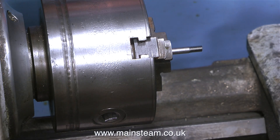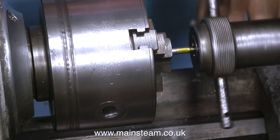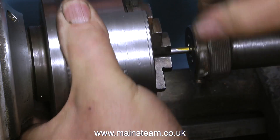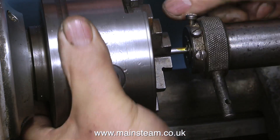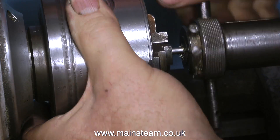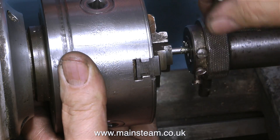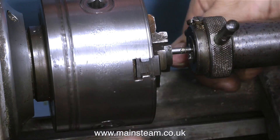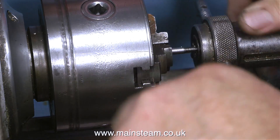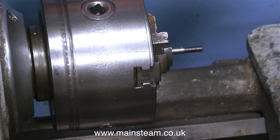The second reason is that a 2BA thread is quite a coarse thread, so the chippings coming off the piece of steel are quite large, and the three holes in the die are unable to contain this quantity of swarf. If you're cutting a finer pitch thread — for instance quarter by 40 or quarter by 32 — the chippings are a lot smaller and do tend to fall out of the holes. But as you can clearly see here, most of the swarf cut from the stainless steel, which is now work hardened, is lodged firmly in the three holes in the die, and potentially this can damage the thread.